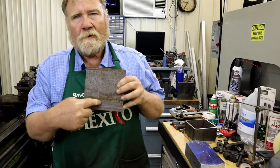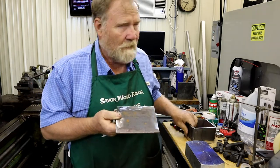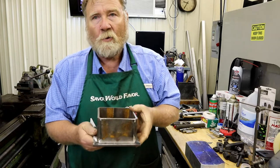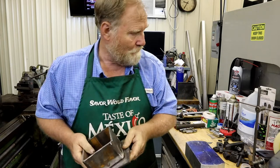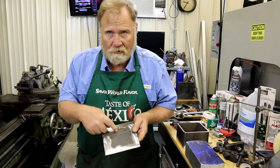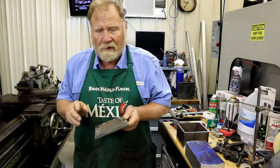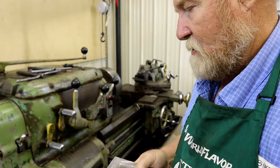Tonight we're going to put a four and three-quarter inch hole through this quarter-inch plate. This is a six-by-six plate I've already cut and prepped. It goes on like this and is welded on to make a watertight seal around the outside, and then the hole will allow the pipe to go through. I could get my old plasma machine out and cut that hole, but I really want this to be a watertight fitting. So I'm going to cut the hole on the lathe with the trepanning tool and then bevel the inside so I can get a good weld all the way around. That way the water or liquid — sometimes I pour a little oil in there — will keep the ants from being able to bridge and climb up the pole.